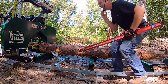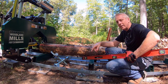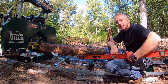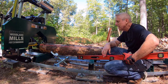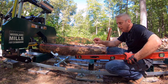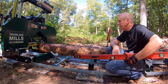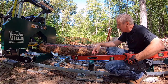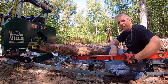These things move all the time, so just like you need to check your track when you get that setup, definitely check the laser. It was a little bit off, and I'm glad I checked it. It just looked off to me, so I grabbed the level and tried it, adjusted it a little bit — the final check was perfect, so it's good. I want to make sure the laser hits the blade there, and the level over here. I think that's it, so I'm ready to do my first cut.